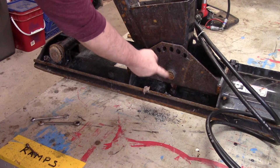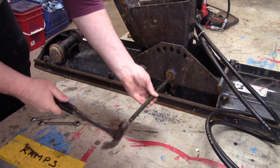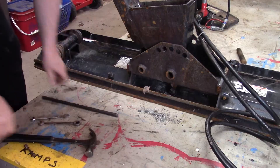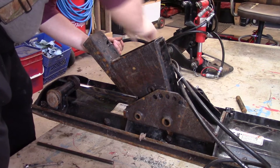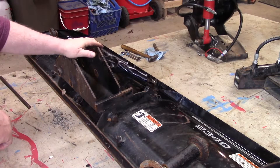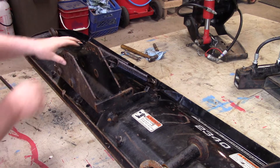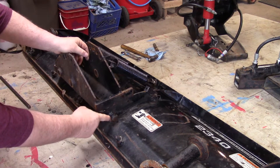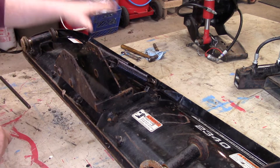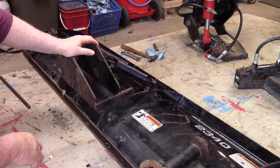There's the pin — comes through the bottom, so I have to drive that through the top. This whole assembly here now should lift right out. I was thinking before I try to clean that off, this yoke right here pivots on this axle. So what I might do is just take that nut and bolt off there, drive that axle out, take that whole thing off, and then the blade will be more or less void of any hitch at all — it'll be easier to move around.